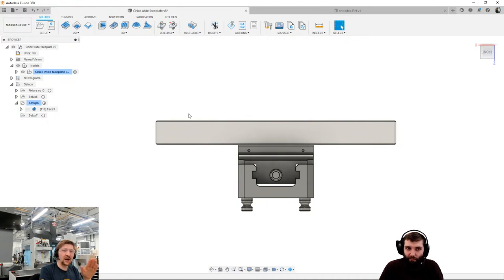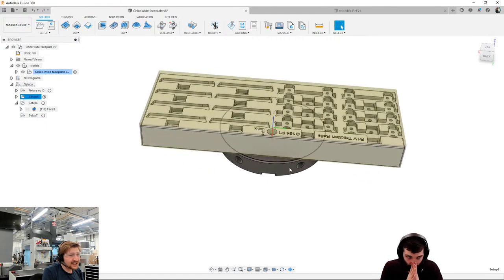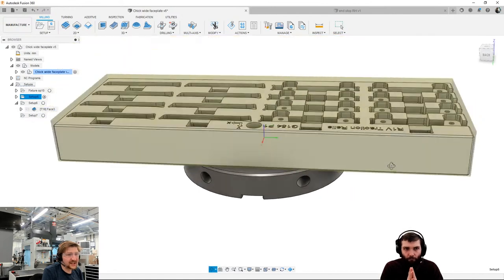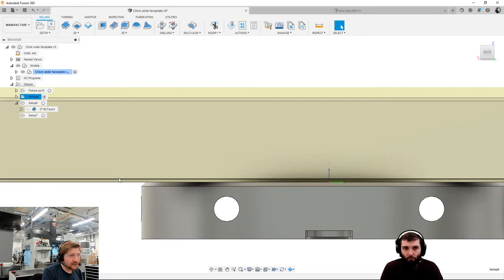The reason I can't mill it all in the second op is, if we have a quick look here at what we've got, we've got my fixture plate there, and these Lang base plates are far too expensive for me to have my end mill cutter scrape the bottom of it. So I need to give myself a little bit of clearance, but if I was to mill up to halfway, you'd have that step where the two end mills meet, one from the bottom, one from the top. There'll be a very slight step, and we're trying to get rid of that. So I'm going to hide that step in the transition of that chamfer to the outer wall. Hope that's clear. Tell me if it's not, and I'll go over it again.